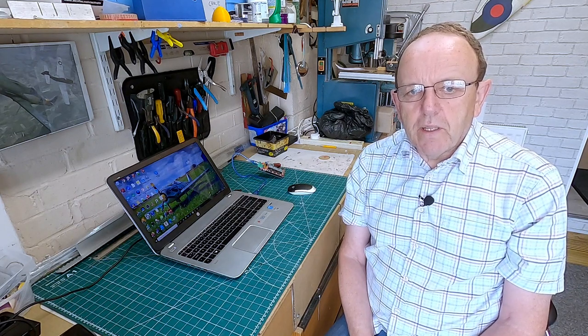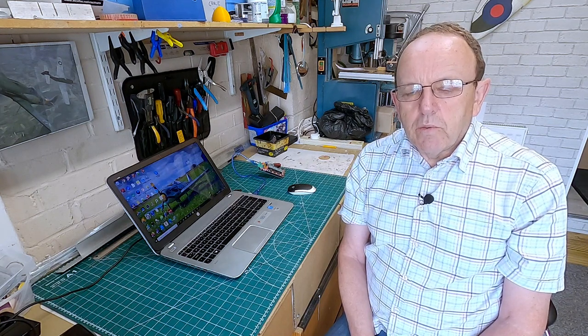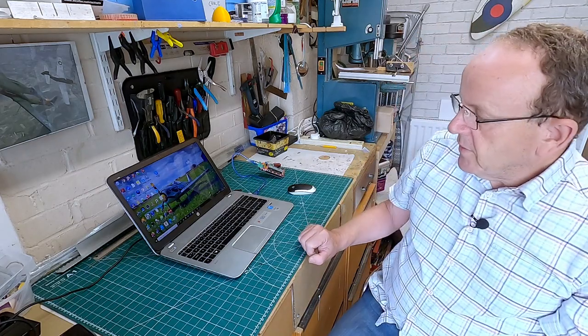So what you need to do is make sure you use screen cable, or you can use opto switches, which are electrically isolated, so they work as well, but there's a bit more involved, so I'm not going to cover that in this video. So what we'll do is I'll go through the setup with you, and then we'll get onto the live machine. I'll show it working. So let's jump on the computer.